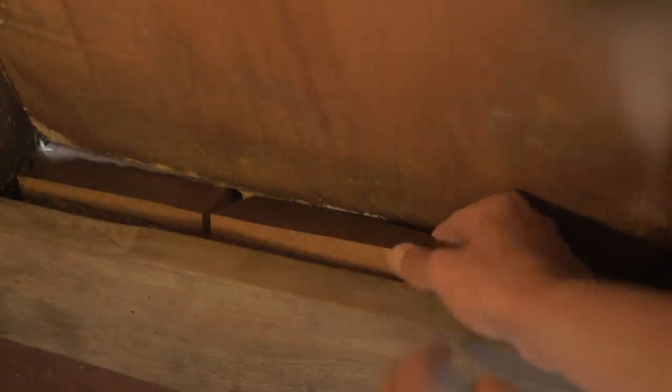Once I removed all the rot, I assessed those timbers below. I'm checking it, and always make sure to check it with a nice sharp object as well. I find that works best. If you use anything blunt and half attempt to check it, you'll never really know, or you'll never break the outer skin of the timber. Sometimes you'll see it's very rotten, but the outside might give a false impression of how the timber actually is. Especially with tapping, I just find that checking with something sharp, you really find out, because you'll find out if the outer layer is hard, and the same if it's gotten soft, and the same with the inside.